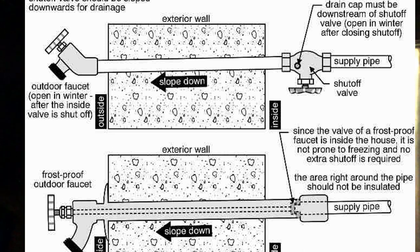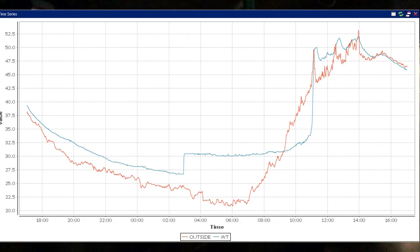I've also done some experiments with a water sensor delivering water to the greenhouse and looking at what temperature it actually freezes out and stops flowing at. It looks like that sits right around 27 degrees. I'll try and dig up the chart from a year or two ago when I was studying this, and you'll see where the temperature drops and then suddenly it flatlines. That flatline is where it freezes solid and stops flowing. Interesting thing to note: water will actually flow and keep flowing below 32 degrees, provided there's enough velocity or energy in movement in it.